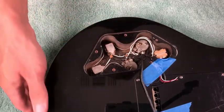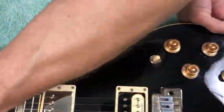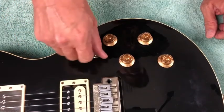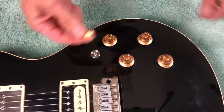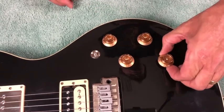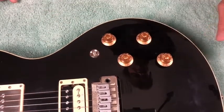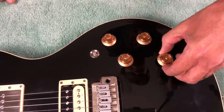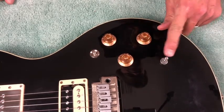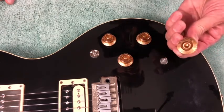Let's flip it over — I'm going to turn it 180 degrees. There we go. I'll pull the toggle switch tip off — we're going to reuse this knob on the next switch. Now we're going to pull off our knobs. With push-pull pots, I just pull up on them, but don't pull straight up — that's how you rip out shafts on pots. I like to wiggle it side to side. And there it comes off. Now if you notice, this is an 18-tooth — that's the way Bourns makes their push-pull pots, 18-tooth, and the size is more of a metric size, so it's more rigid.